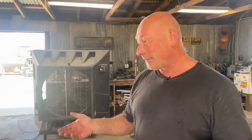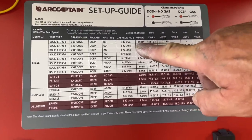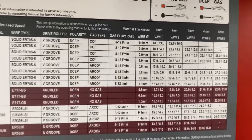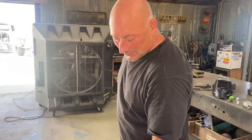I was using the smaller 110-volt welder for all my sheet metal work because I was able to run the .023 wire. I usually use two machines — one with .030 or .035 in the bigger machine, and then the smaller one for sheet metal I like .023 or .025. In this new welder it's metric, so it's 0.6 millimeter. That's the little thing I'm struggling with — I'm just an American mutt. I had to order the proper tips for the small wire; I was using the larger tip. It still welded, but I'm waiting on the right stuff.